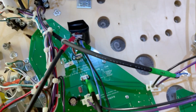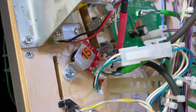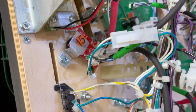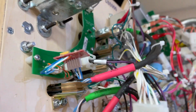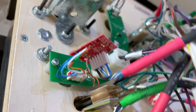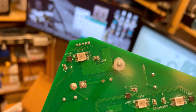It's the last LED in the chain, but it seems to be a common problem that the last LED's the one that burns out. So the boards that I've designed, like this one here, you can't see it on this side, but it's basically got an output buffer, and there's a bunch of TVS's, and a lot of input and output power and signal filtering on these boards to just try and keep them alive. And up here on the multi-LED boards, I've got my own power conditioning board, which you can see here. Here's the fish board, and you can see that last Allegro chip is toast. So we've got to sub that one out.